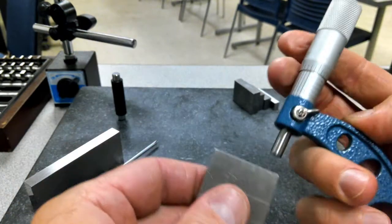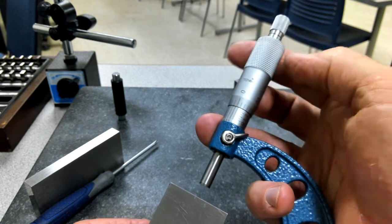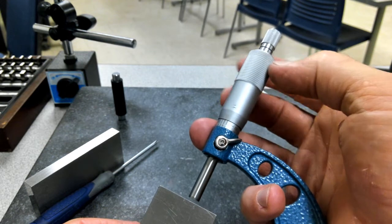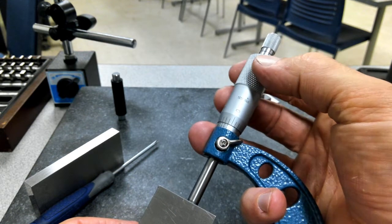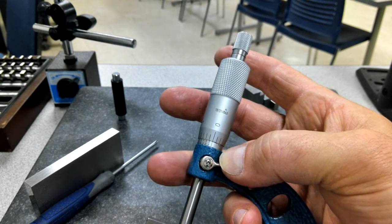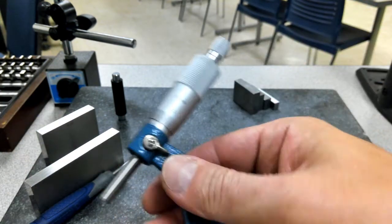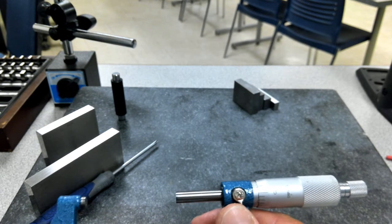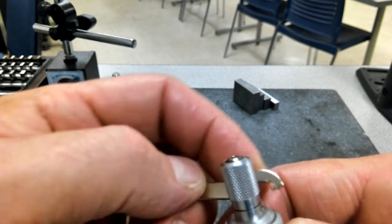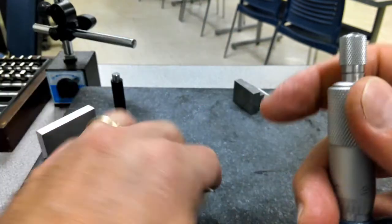Okay, so I come in here with a 2-inch gauge block, or my standard. And again, don't be afraid on your own stuff to check this, make sure that they're right. You do not want to assume any of these things. So there I'm at 2 inches, and I've got 0 tenths. So I'm dead on right there. I'm assuming, since I didn't change anything, that the end will still be the same, so it'll probably be 2 tenths off on the end. If I need to work on the end with this part, I can. If I need to remove the ratchet, I can.